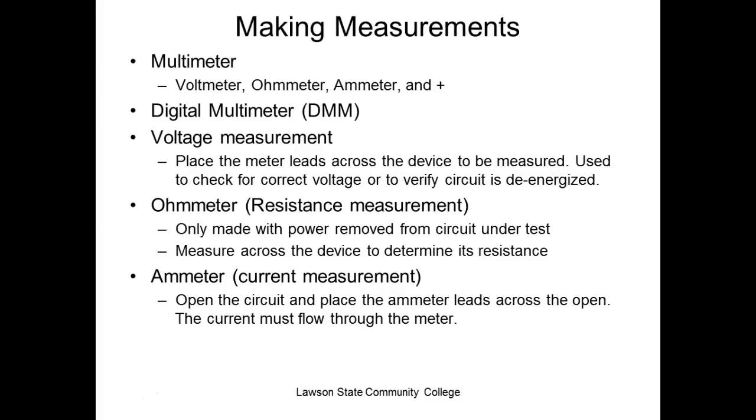The voltmeter, what we do is we have power on the circuit. Well, it depends. Out at US Steel, if we were going to connect a meter into a circuit over 500 volts, we would have to turn it off, put the meter in there, and then turn it on. So we literally were not supposed to measure over 500 volts with a live circuit. Okay, so it all depends on where you work. I imagine it's stricter than that now. So we didn't have to wear all this stuff. There was no such thing as 70E when I was working at US Steel.